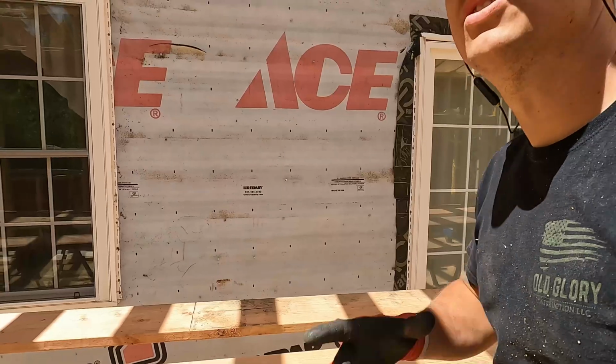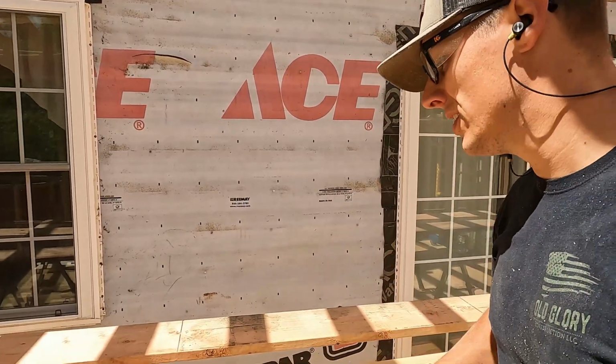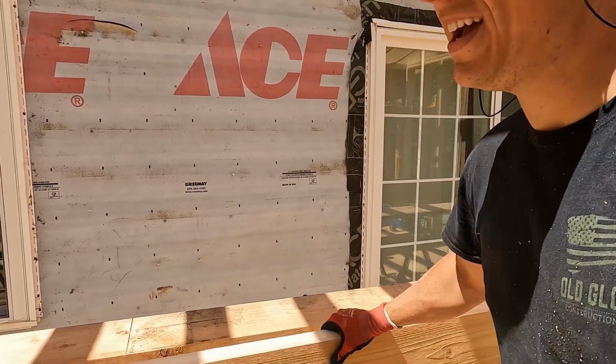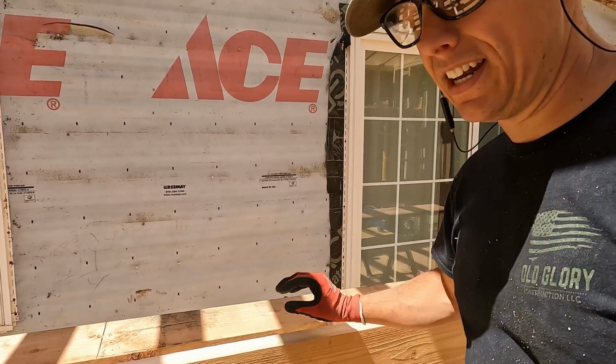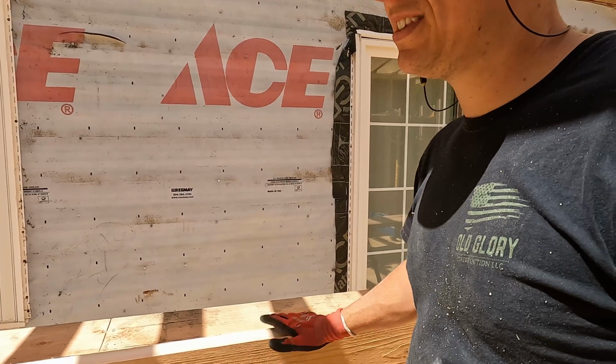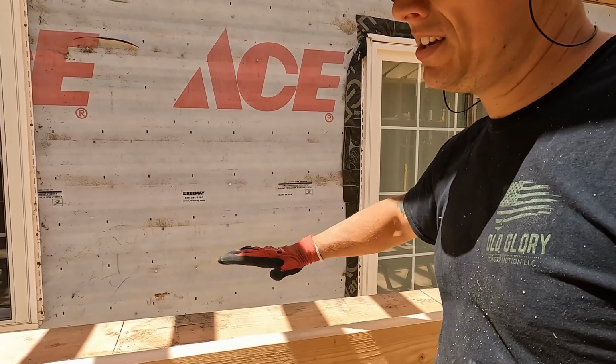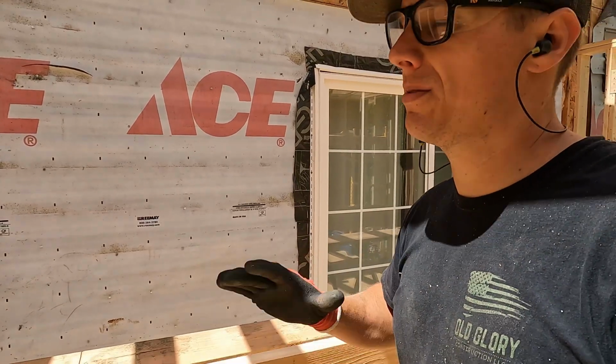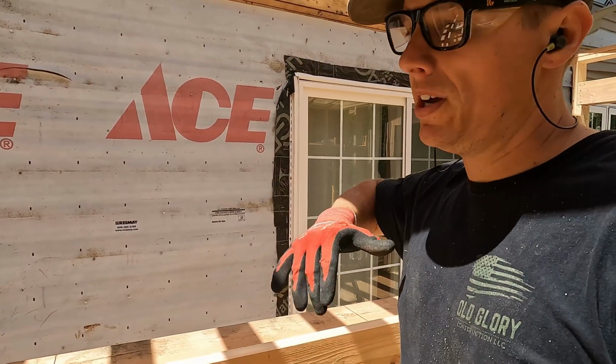So the face of our rafter tails are 8 inches, so I cut this at 10 degrees on the top, and I added about a 1/2 inch to get that 5/8 sheathing, so it'll catch right on the bottom and you won't have to worry about flushing it out at all. It's gonna be nice and easy. Bump right up to it and we'll be done with it.